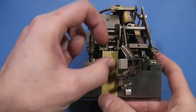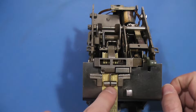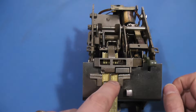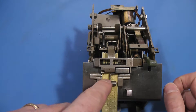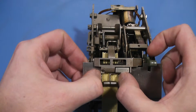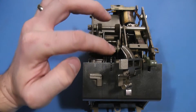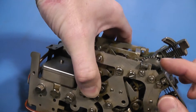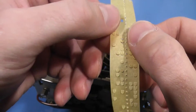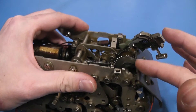These little guides serve to hold the tape in position as it reads up and over the unit. You place the tape in here over the little drive wheel, close the gate, and it runs up through there. These serve to center it. These grooves here — if the tape is printed with characters, they will be printed six spaces behind the holes that encode a particular character. So you line up the character you wish to send first with these markers, then run the tape and it will transmit it. This wheel is the tape feed wheel; from the side it has a bunch of little round-ended pegs that fit through a row of holes running just off-center on the tape, used to guide it through the machine and control the speed and spacing at which the tape advances.